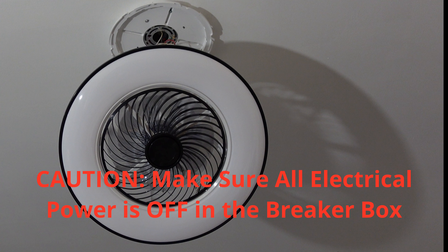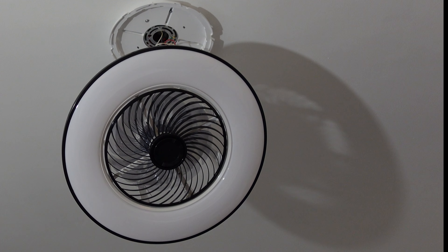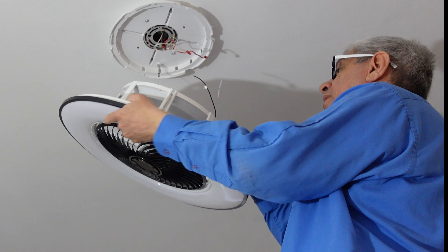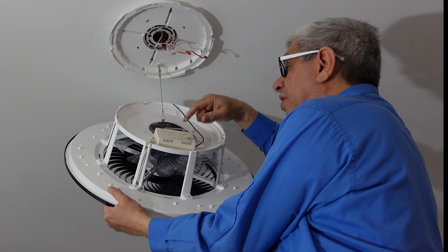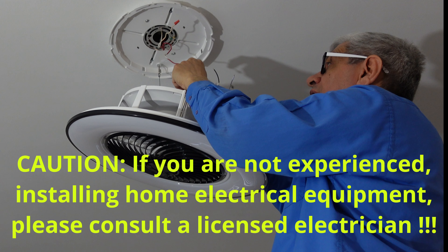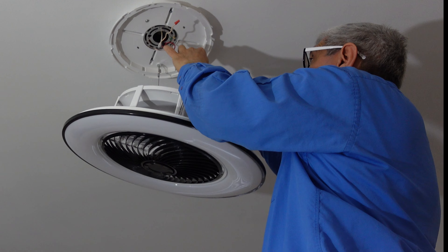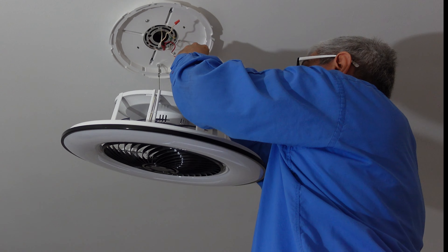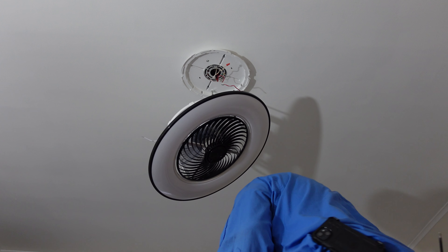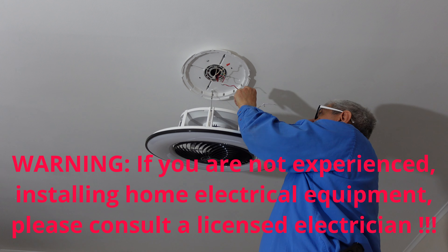I got it up there finally. Now I've got to connect up the electrical wires. It's dangling right now from a little hook that it comes with that connects up to the base — I strongly suggest you use that unless you've got two other people to help you on ladders. Here you can see the little hook with a steel cable. Black is hot, so I'm going to hook that to the red wire. This particular one has a white and a red — usually it's black in the wall, unless it's coming from a switch, which this one is. I tried one of the wire nuts that came with it, but I had to strip the wires back a little bit more on the fan side since they wouldn't strip back enough.